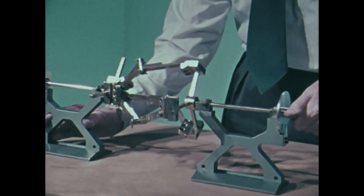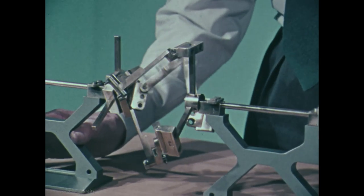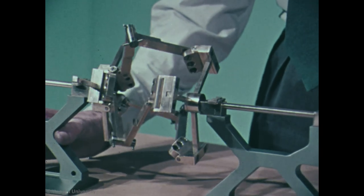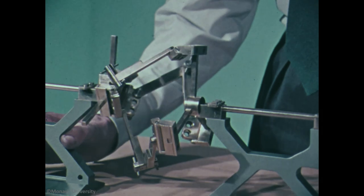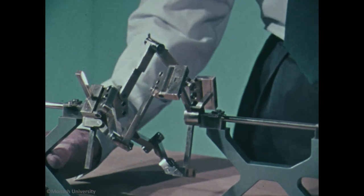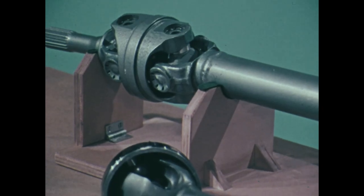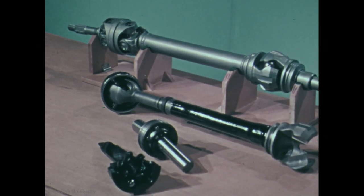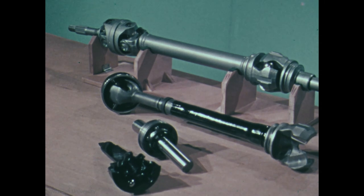But of course, to convert any one of these geometries into a realistic engineering design requires a detailed knowledge of the particular situation. There's no problem in any of the new couplings about balancing them, statically and dynamically, either perfectly or very nearly perfectly. Power couplings, particularly in automotive transmissions, seem to be quite well covered by existing rugged and compact shaft-intersecting couplings that transmit uniform speed adequately precisely. But in precision engineering of one kind or other, there could be some applications for new couplings included in this wide range of newly revealed possibilities.